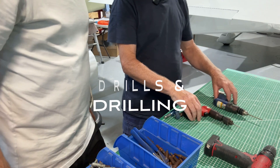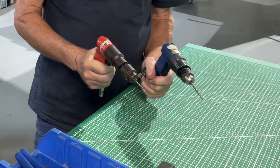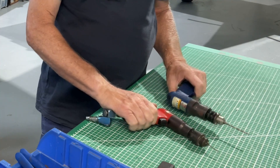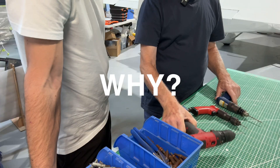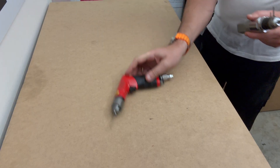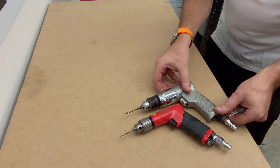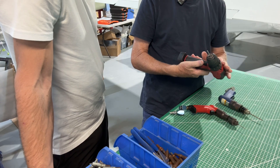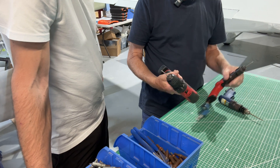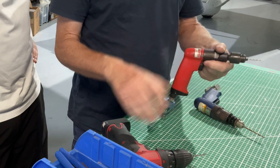Your tools and equipment. Air drills are better for drilling through aluminium than electric. Why? Because air tools can reach higher RPM. The faster you drill through, the better the hole. Normal battery drills don't drill as fast. We can follow the RPM on this — 1500 RPM.